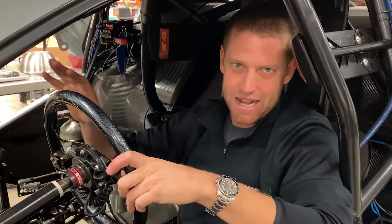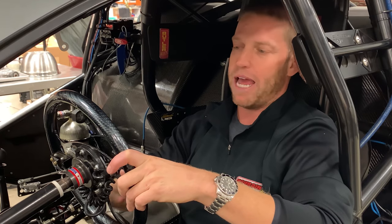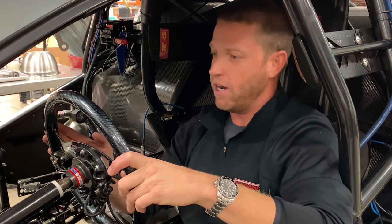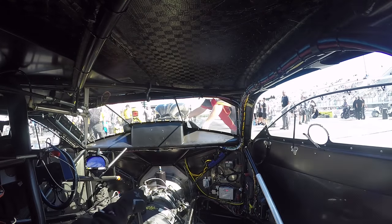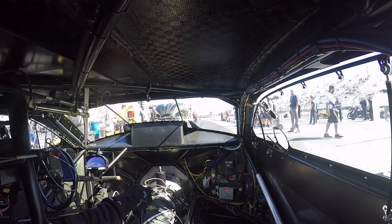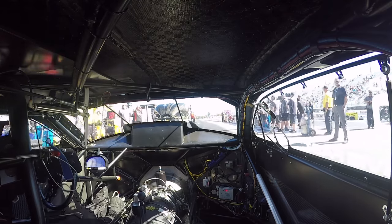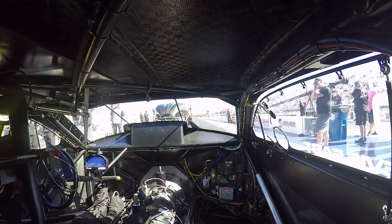I like for it to run for about 10 seconds. You'll see me just sit there for a little bit. I'm watching the engine RPM come down. I'm watching the oil pressure come up. I watch the head temp start ticking off. I'm looking at CO2 pressure. They come over, unplug the starting accessory booster pack, shut the door, latch that door. That's the last time that door opens, unless there's a problem. Gives me the thumbs up, and it's time to roll it into the water.